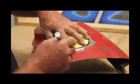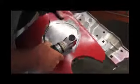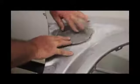The replacement panel can be sheet metal or even part of an old panel. Place the material on top of the metal you intend to use as the inlay and trace around the outside. Using an air nibbler again, cut out that replacement panel. Check the replacement panel for fit — you can clean up any overhang with a bench grinder.